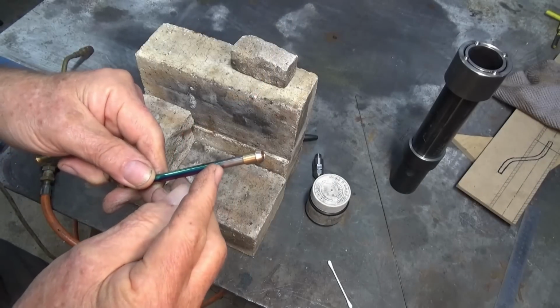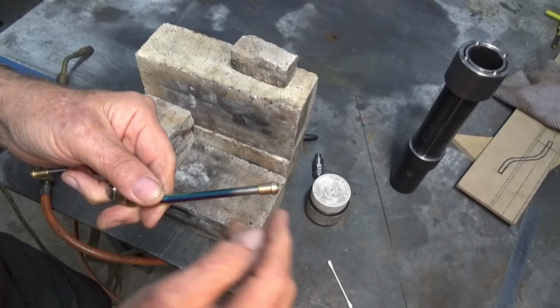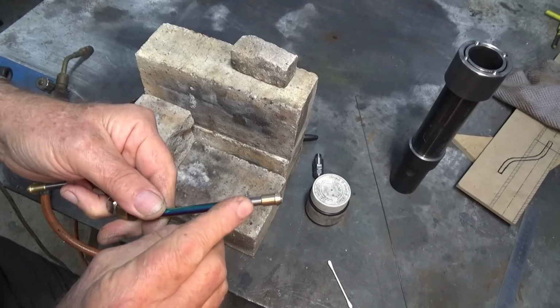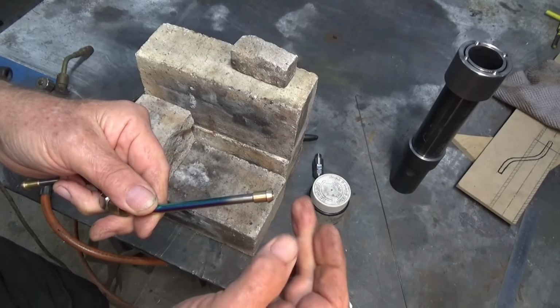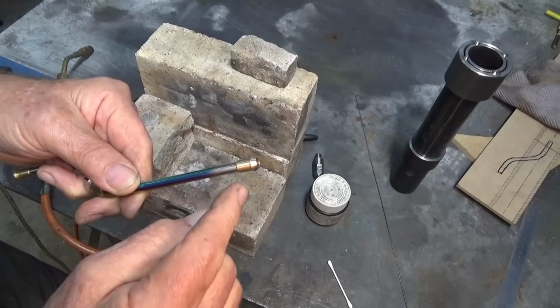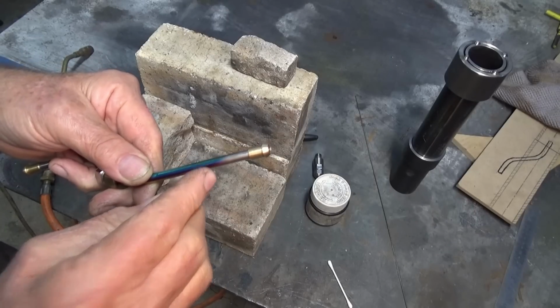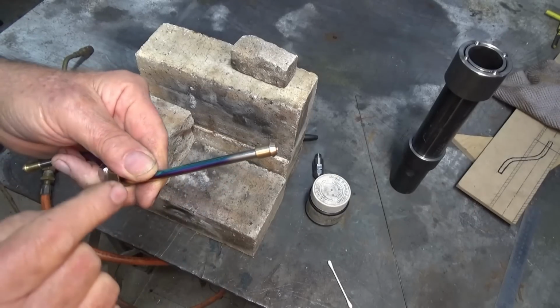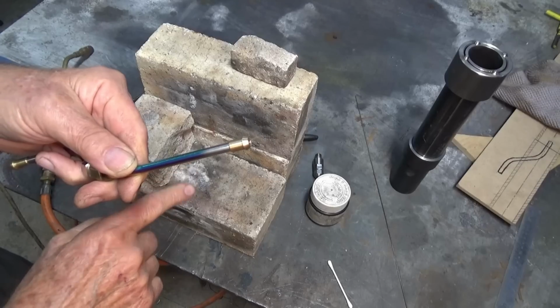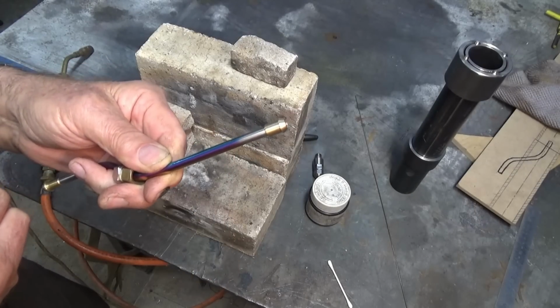Let's just polish the end of the stainless steel tube. And these brass fittings are a fairly loose fit on there, because we want the silver solder to wick into the joint. Now, there's a chance that one of these will have to come off again later on, but today I just want to hook it all up and just see if the pump is going to do its job. So I'll get these silver soldered, and I'm just going to use a small propane torch to do this with. I don't want to overheat this.